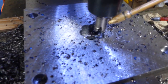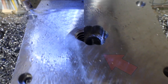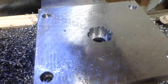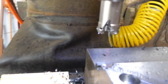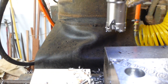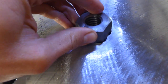Just a little more cleaning up and the acme nut will fit right in. I had to plunge six more locations to get these points down so the nut would fit. Amateur night at the Apollo continues — I hit return to zero, forgetting that Z zero was below the surface of the plate, and this happened to be the day I forgot to bring spare inserts. Hoping the tool isn't totally destroyed. I put a high-speed cutter in there and finished plunging the last two. Does it fit? Yes!